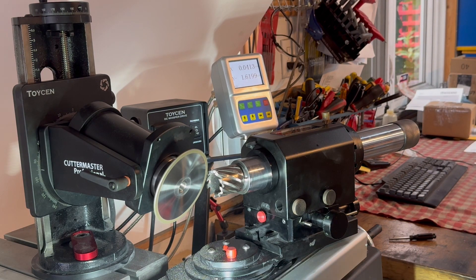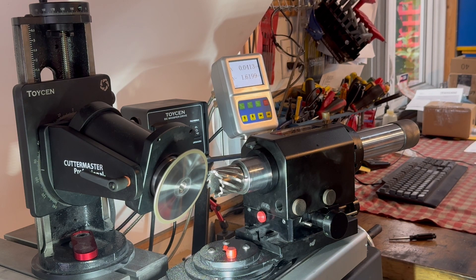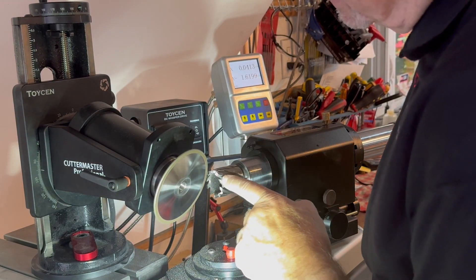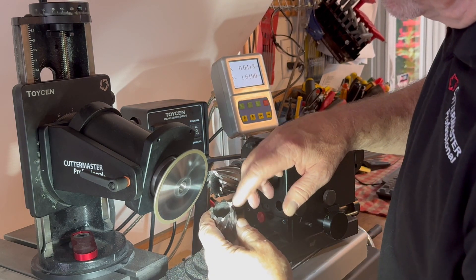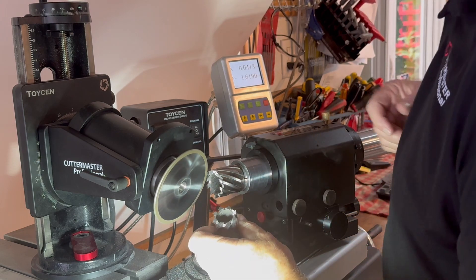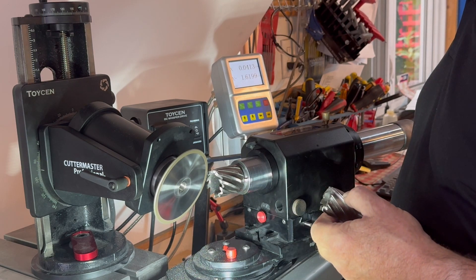You want to keep track of your length. All annular cutter manufacturers and tool designers have a method for keeping the chatter down. This method can be staggering the tooth length — in some cases every other tooth has an elevation difference of two to five thousandths. This one has a radical double grind every other tooth and a single grind on this tooth. This one has a big flat grind and just a little clearance grind on every other tooth.